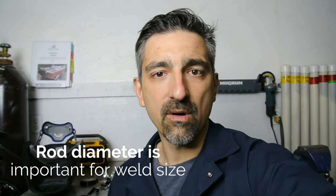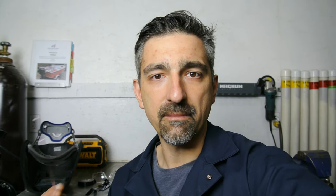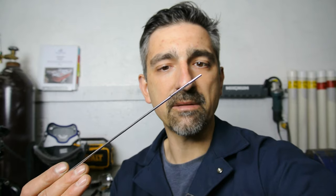I said I was going to talk about 5000 series aluminum - that's primarily the aluminum used for building boats. You've got to use an appropriate filler rod to go with that. In this case we're using 5356, and this is a 3/32 diameter. That's the rod you want to use for 5000 series. Don't be mixing different filler rods. Make sure you have a look at the little flat section on the back and actually make sure you're putting the right stuff into the weld pool.